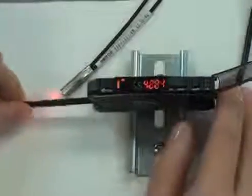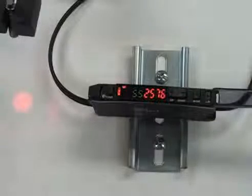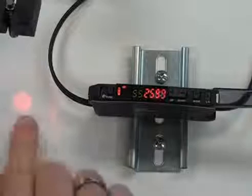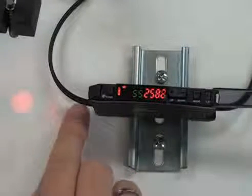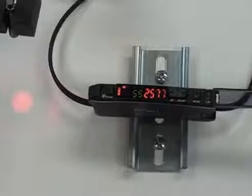You'll know it's locked because the fibers are secure and the lid can actually close. I now have the fiber optic head mounted — you can see there's a clamp up here with it clamped in, and the beam spot is down on the table. Keep in mind the fiber amplifier holds the emitter and the receiver, so the light is traveling from the amplifier through the fiber optic cable out the head, and once the light bounces off the table or your target, it goes back up through the fiber optic cable to the amplifier. The amp is really going to be the brains of the operation.